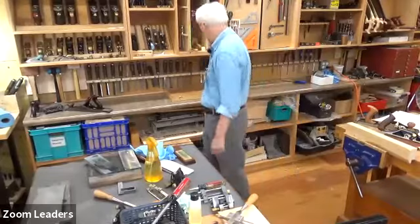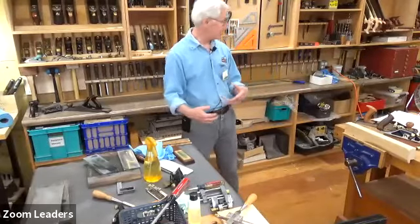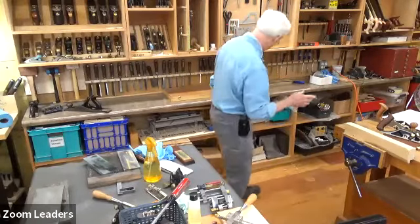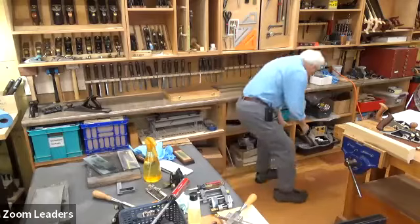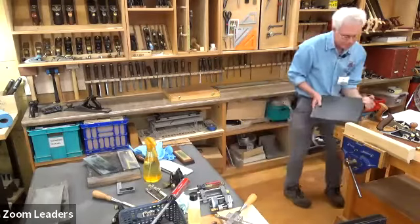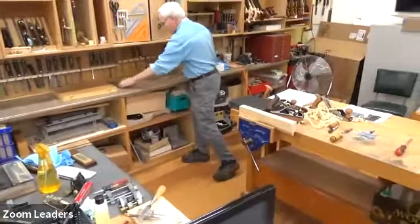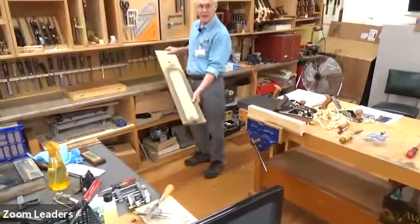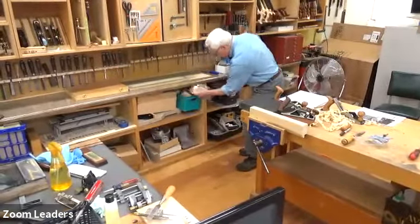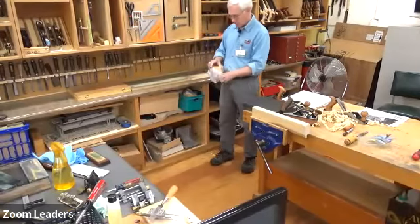Scary sharp is a technique, and in the original document, that's a link, and it'll take you to, I think, the Wikipedia page. Anyway, scary sharp is using sandpaper on some kind of medium. These plates are great. We have a long piece of glass here that you can put this sandpaper on. I think we have 150 grit, we have 180 grit, and it's sticky.